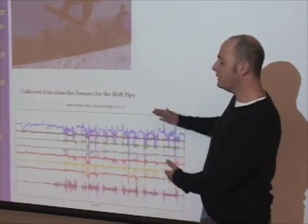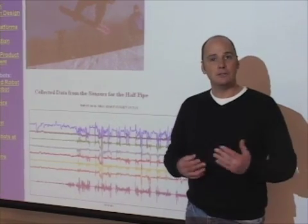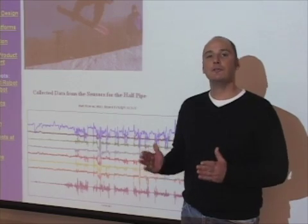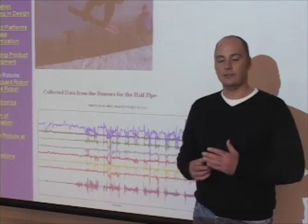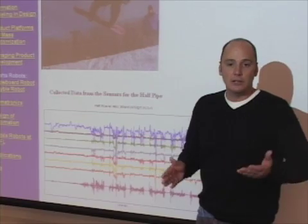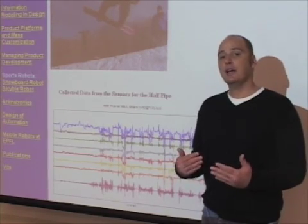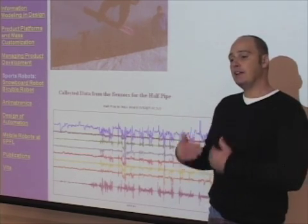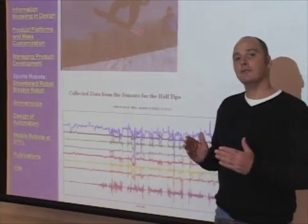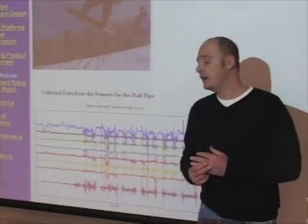The other benefit of collecting this data was that it helped us do testing in a more controlled environment in the laboratory with a snowboarding robot we designed. If I asked you how much force you use to make a turn when snowboarding — how much you lean into the board — you really couldn't tell me. You just start to lean and then adjust until you get the results you want. That was a challenge for us, because we needed to know how much force to put into the snowboard. Because we had this instrumented data, we put the snowboards onto the snowboarding robot and adjusted the forces until we got the same types of performance squiggles in the lab as we saw out on the mountain.